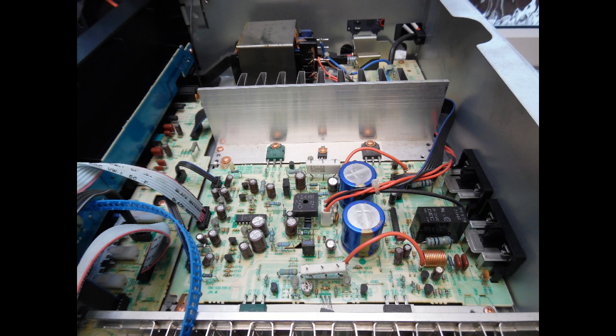It's a really nice amplifier to work on, and the sound reproduction from this amp is really very good, as is the case with most amplifiers. In terms of the approach: if you turn the amplifier over you'll find a service hatch. You remove multiple screws, take a pair of cutters, cut the links, and remove the plate. However, I would tell you not to do that, because you can't get full access to the amplifier board by doing that.